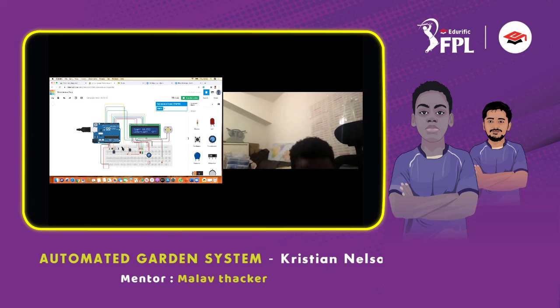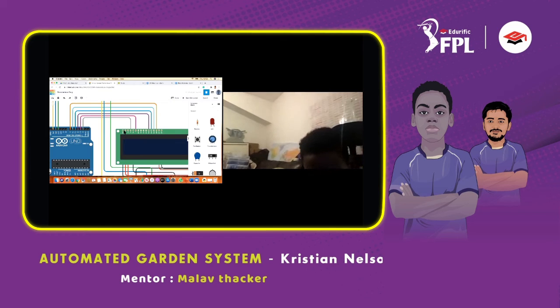And there's also a breadboard and everything. I also forgot to share the pins of the LCD. So this is ground, so a black wire will connect to ground. And then this is power. A red wire, I think, will connect to that. Yes. And then this is contrast, where a red wire is connected to that too. This is the register select, and the register select is going towards the Arduino on 2.